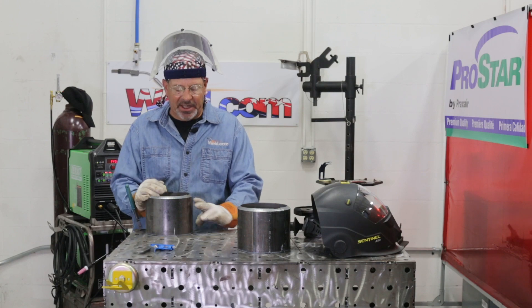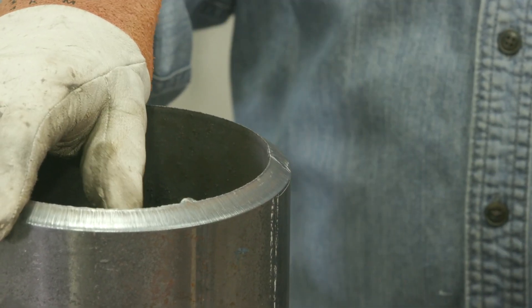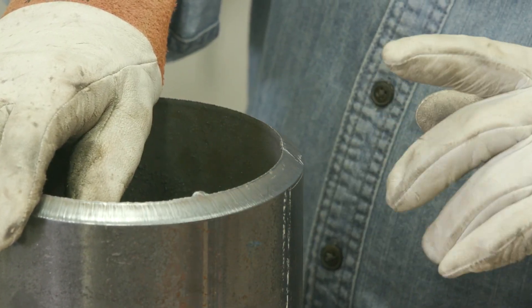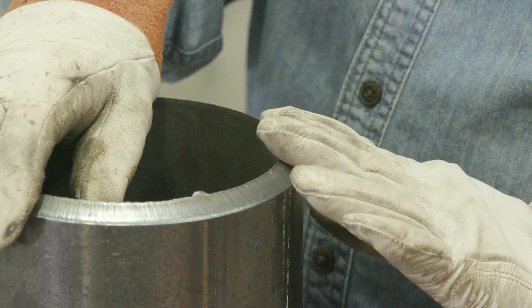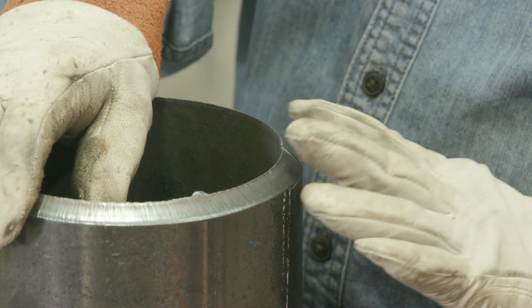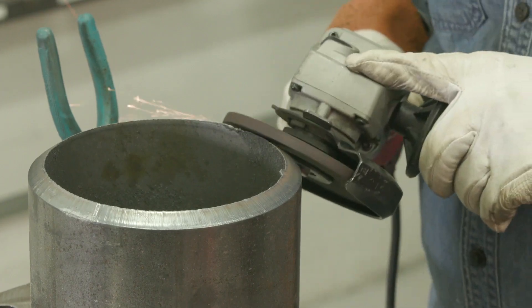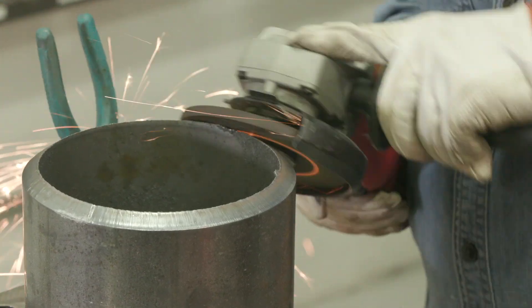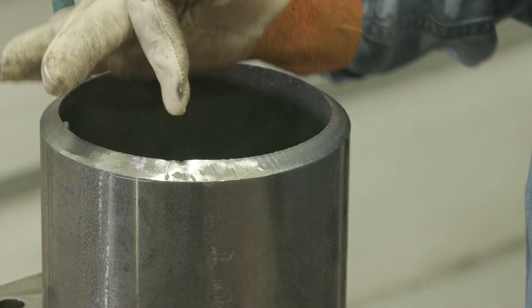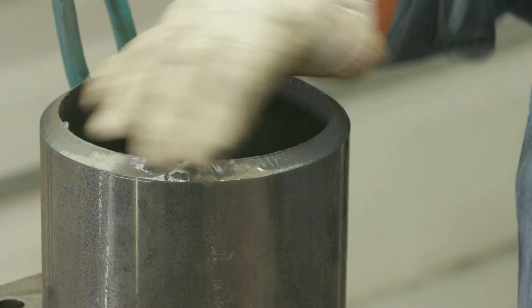First thing I need to do is kind of flatten this off. This is a plasma cut surface, so I need to clean this nitrided surface off of here. I'm going to do this flat — I'm not going to get into the bevel and rebevel it or dig. I ran this flat and I'm getting into these areas — obviously that's real clean, but I still have this depression in here and I kind of need to clean that out.